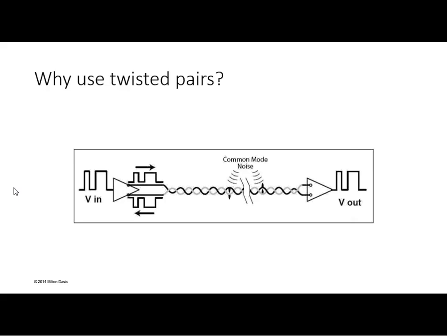One of the other things that's stuck with me over the years is that one of the experts at Belden told us, as we were researching category cable acceptability, what provides more immunity in different situations. From their view, the differential signal, the twisted pair nature, actually provided more immunity than even the shielding did. At the data rates we operate at, the shielding was beneficial, but it's the twisted pair nature where we get most of our noise immunity. So let me go ahead and move it on.